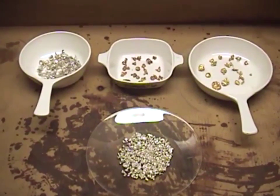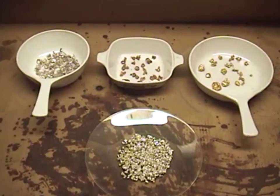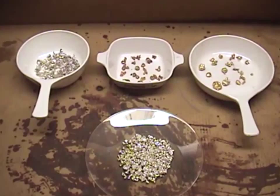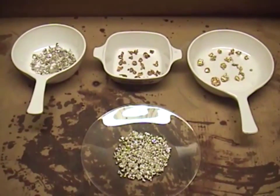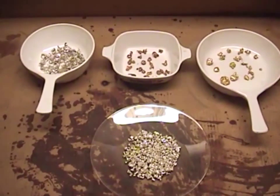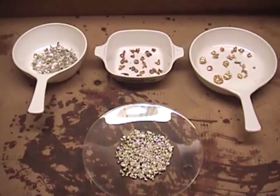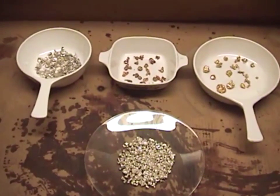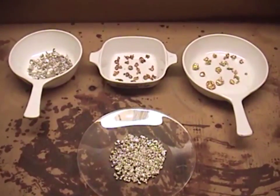How quickly your electrolyte is depleted will depend on how trashy of a copper product you introduce to the cell. Remember when we dissolved all of our sterling silver into a nitrate solution and dropped it with copper — our silver cell works basically the same way. We make up a pure silver nitrate solution, and as more and more copper is dissolved out of the feedstock, copper goes into solution and starts to push the silver out of solution, just as copper precipitates silver from a nitrate solution.